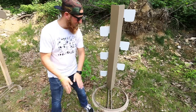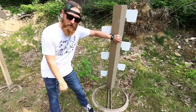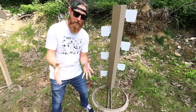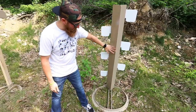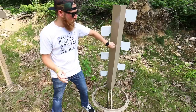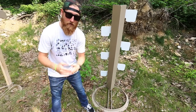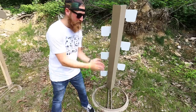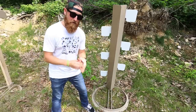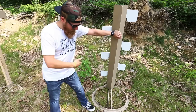One more thing and probably most important: a lot of companies out there sell these trees, but if you're buying one to specifically shoot rifle ammo at it, you've got to make sure it's rifle-rated. There are companies that sell rifle trees, however they overlook the fact that you're going to be hitting shots right on the front plate. As of right now when filming this video, TAT is the only company that makes the front frame of their dueling trees out of AR-500 steel. The paddles are 550, the frame is 500 — basically the same hardness of steel that other companies are making their normal plates out of. If this was a softer steel like a lot of the competitors, any shot you land on here would more than likely just punch right through. This, however, is at a nice 45-degree angle when shooting from the front, so any shot is going to ricochet right off the back and go into your backstop.